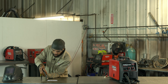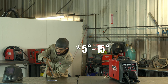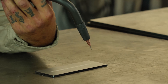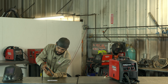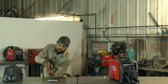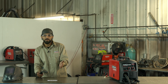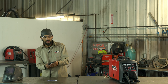Now let's talk about position — how far you should hold your gun away from your material. For basic practice, on your scrap just come in and make a straight line; it doesn't have to be perfectly straight. You want your wire to be about three-eighths of an inch sticking out.